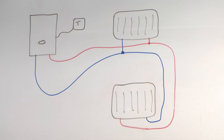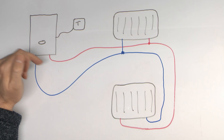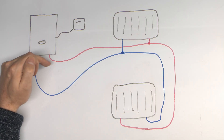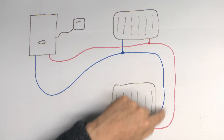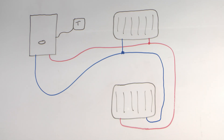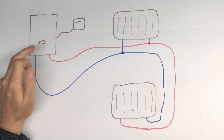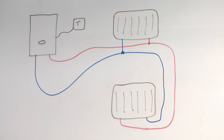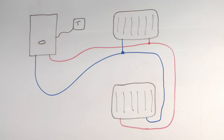This diagram is a basic overview of the heating system with a combination boiler. We've got the boiler here, any kind of thermostat is connected directly to the boiler, and then you've got these two pipes from the boiler — the flow shown in red goes out to each radiator in turn, and then the blue return goes back from each radiator to the boiler. Everything else is contained inside the boiler: the pump, and usually a valve to divert water through to the heating part. So this is just a single zone, the basic setup, with two radiators representing upstairs and down.